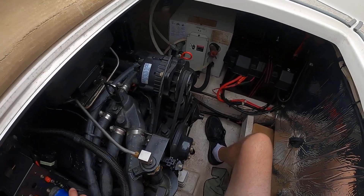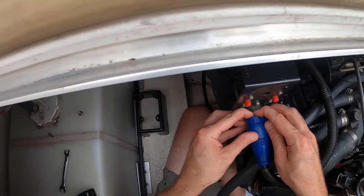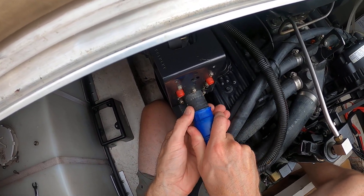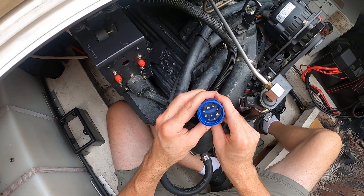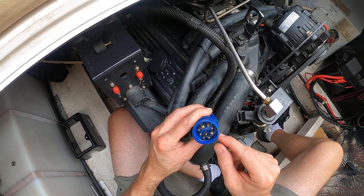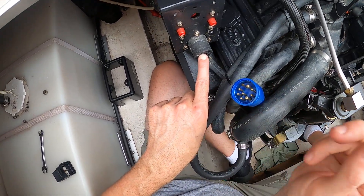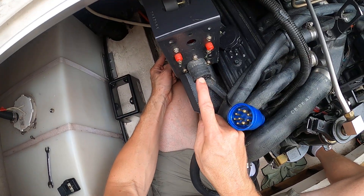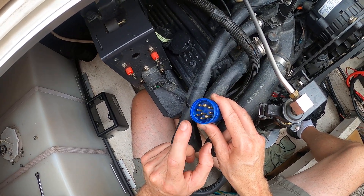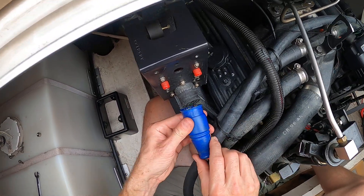This relay was found underneath this cover. The cover had been hose-clamped on, and instead of just pulling and reefing on it, I walked it off by slowly pulling up all the way around until I could finally pull it off. From there, I didn't know which terminals came back from the ignition switch, so I went one by one. I ended up going from this terminal post down and found the least resistive connection, which told me this post was the same as this one.